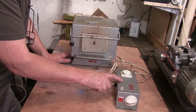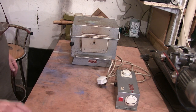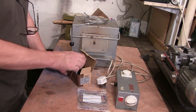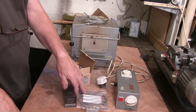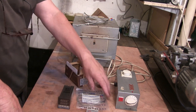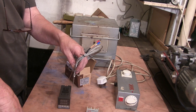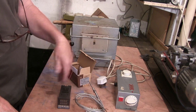So I'm thinking of not using that controller. The modern equivalent is very expensive, but I thought I'd try putting a PID controller on it. So I bought a little PID controller, a little relay, and a thermocouple - all as a K-type thermocouple kit. Problem is that one is only a 400 degree thermocouple so it's no good, so I also bought a 1250°C thermocouple. This whole lot was about 25 quid.